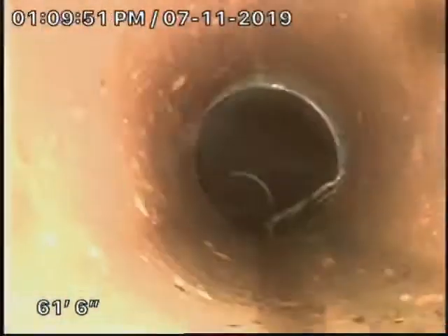Making an inspection video of a lateral we just cable cleaned and jetted. We're about 78 feet in — there's the city connection. Pulling back through six-inch clay with really heavy roots through here, transitioning to the four-inch.